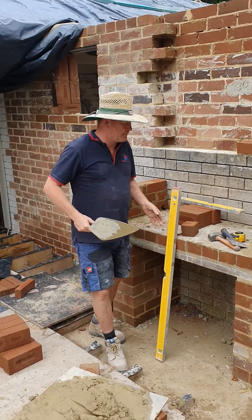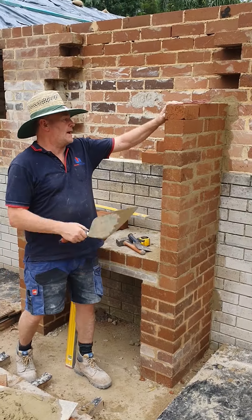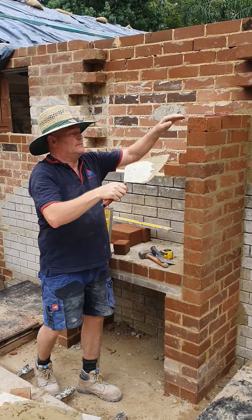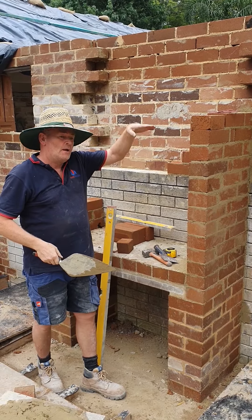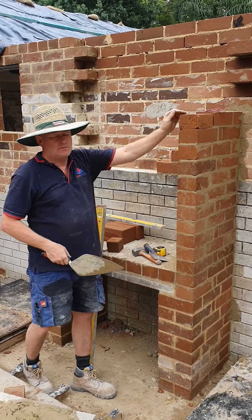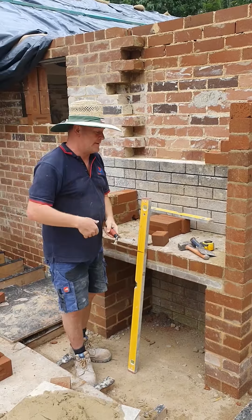This brick was left out because this brick is the head on top of the barbecue. This brick will have to be cut down to drop the head below the barbecue level so it could be rendered, and the next brick — of course — I'll have to make that up as we go along.